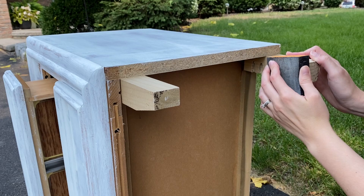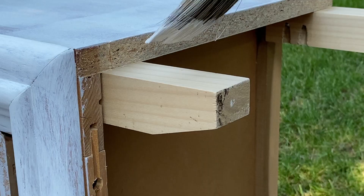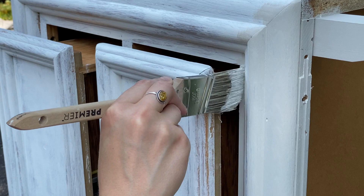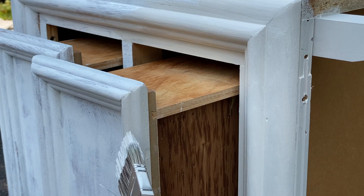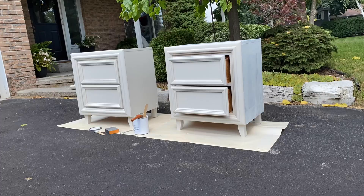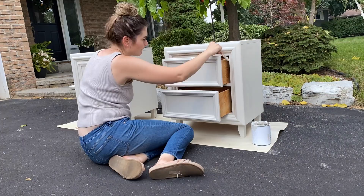It was time to paint! I decided on a really beautiful neutral grayish color called Sandstone by House & Canvas — a chalk-style paint that is really thick and smooth. I'll link all the products in the description box below. I started on the underside and painted the legs first. My pieces had so much trim work that I opted to use a brush to paint the entire thing, though a roller would work well on flat areas. It took a while, but I took my time to ensure I wasn't leaving paint drips or thick brush strokes. I made sure everything fully dried for a couple of hours before re-coating, and in some areas I even did three coats for really even coverage. I let the tables dry for a couple of days before picking back up.